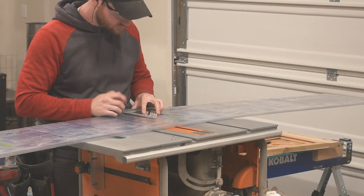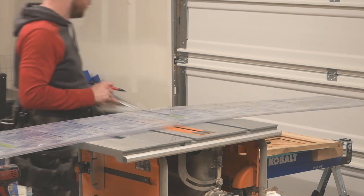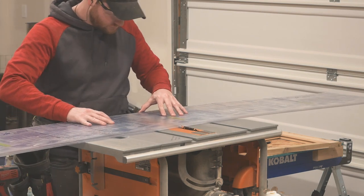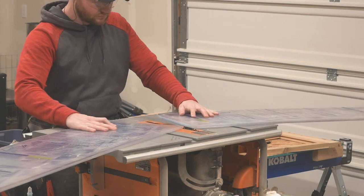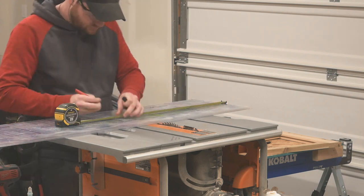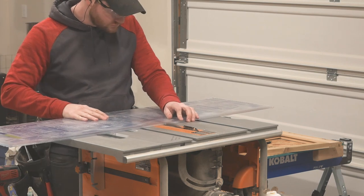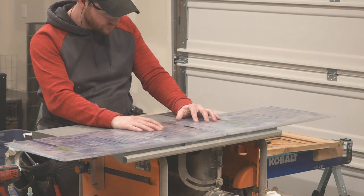For the paneling, I'll be using some clear polycarbonate. This material is what makes this project a little spendy. Because my saw only has a 20-inch rip capacity and I need 22.5, I had to mark the cuts with a square and make the cut without a fence. It's cuts like these — with floppy material that require getting your digits close to 6,500 RPMs of carbide — that make me nervous. I keep thinking about buying a SawStop, but that company's high prices and crony capitalistic behavior are giving me pause. I guess one trip to the ER would cost more, so maybe it's not the time to stand on ethical ground — even if they're scumbags, they will save your hands.